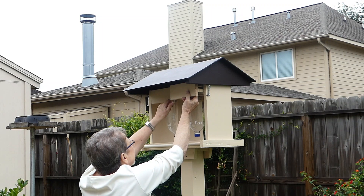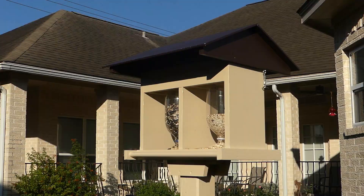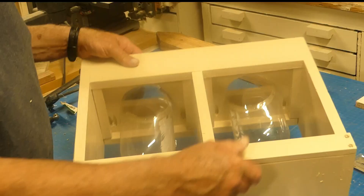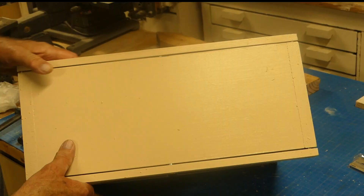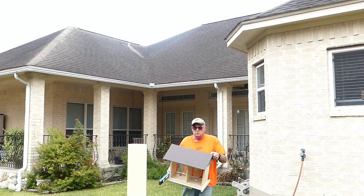Let's take a look at what we're building. The heart of the feeder is the cartridge bottle holders. They'll load about three or four times as fast as the funnel method used for traditional bottle feeders. The roof has a generous overhang and our seed has stayed dry through several rainstorms. You only need to lift the top for cleaning and it doesn't impede the cartridges loading in any way. The seed area is designed to automatically drain water to the outside via slots, just in case water gets in. There's a nice perch assembly on both sides, and we'll also show you how to make a mounting bracket for either a wood post or a metal pole.